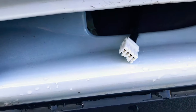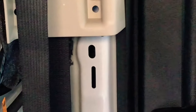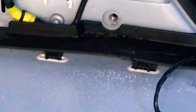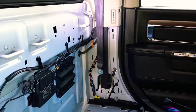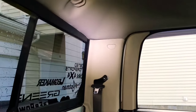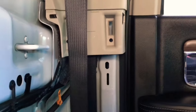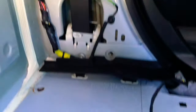I'm back inside checking — I don't see anything on this side, but I'm looking over there and I can see water dripping right from there. There's a drip coming down right there, and that's fresh — that only happened when I just put the water in. It's weird because it comes from like the corner. The water must travel down and somehow catch the outside of the right side of that panel and come down. There's a drip going down, and that's exactly where I originally saw the water.